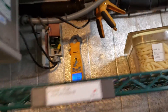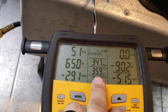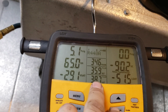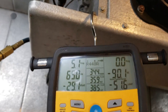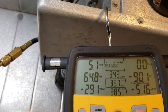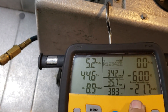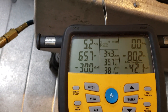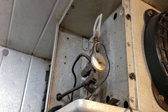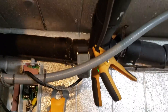Check this out — the solenoid valve is stuck open. Look at my liquid line temp and my suction line temp. It's ever so slightly bleeding by on the suction line. And you can see by the thing frosting up, it was bringing the box temp way cold. So we've got a bad solenoid valve.